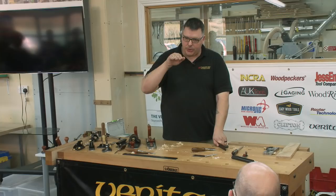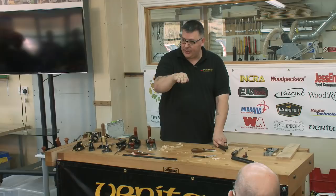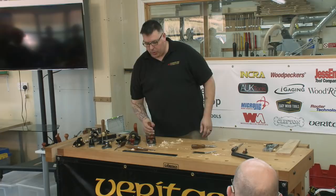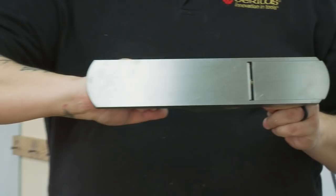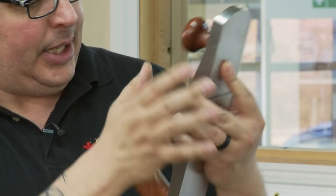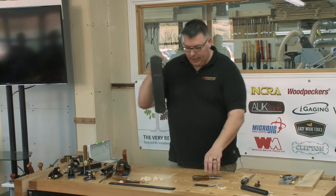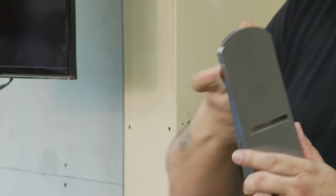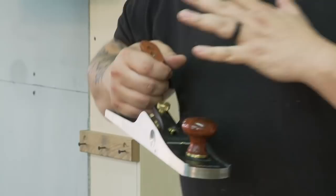For coarse work I just loosen the mouth wide open. I can also close it using the depth-limiting knob to avoid smacking the blade, putting a very tight mouth on for super-fine cuts. So in my lazy planing I have it open for roughing down to flat, then close it back, back the iron off just a whisper, and do a finishing cut. When taking the blade out to sharpen, I always open the mouth wide — I'm not worried about the blade coming out, I'm worried about it going back in and smacking the toe on a freshly sharpened edge.